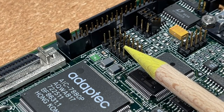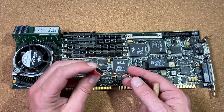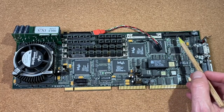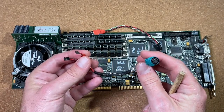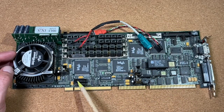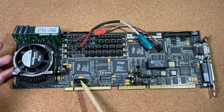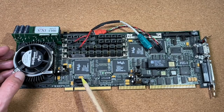Over here we have a 4-pin header for USB, where I made this cable and this connector, which gives me at the end the possibility to transfer data much easier. Yeah, next to it we have some headers for our PS2 mouse, which is also not a standard connector, and I had to assemble something special here to be able to connect my PS2 mouse. Yeah, the signals for the keyboard we can find over here on this 8 or 9 pin connector. I was able to find out where the 4 wires need to get connected. Yeah, plus 5 volt, ground, data signal and clock signal we need at the end for the keyboard. But later on you will see where we connect these.